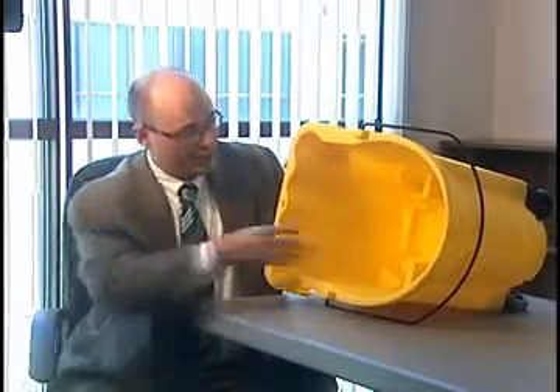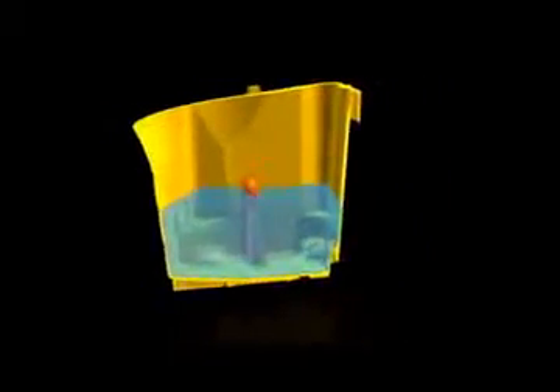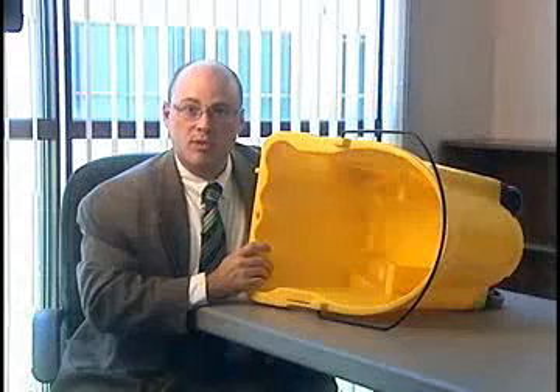The last thing, which of course is the wave breaks, are the internal baffles that extend from the bottom of the bucket to about midway up. They are constantly breaking the surface tension of the water at their point of highest energy, which is going to be in the center. Not only does it reduce the velocity, but it also dissipates the energy throughout the entire flow.